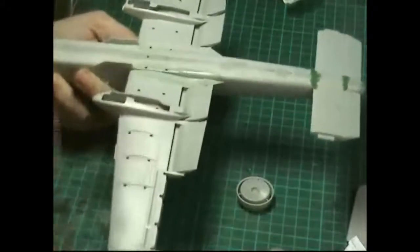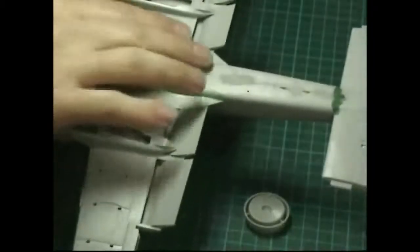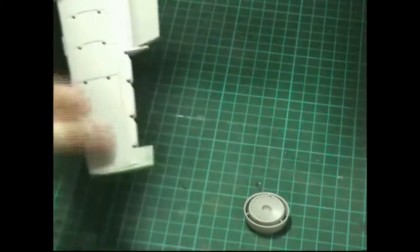Once you're done, give it a quick blow and it's job done - very easy, very straightforward. Allow for shrinkage because it will pull in and dry back slightly. Don't go in with your files or try to sand this for a few hours as it will make the plastic quite soft and tacky. You need to avoid it, but as you can see the curved areas are done nicely.